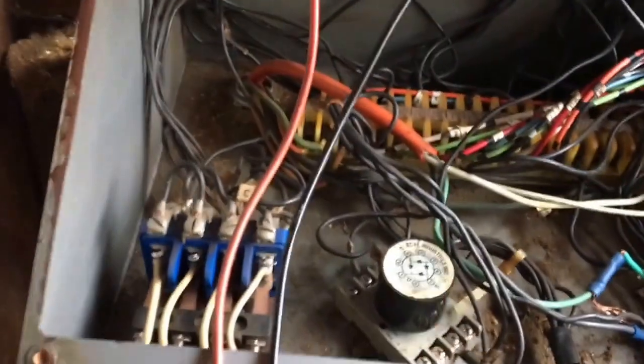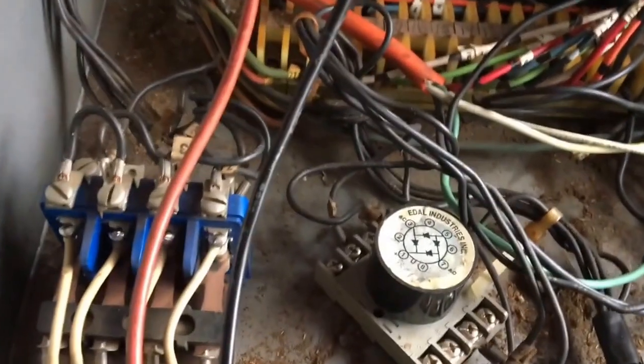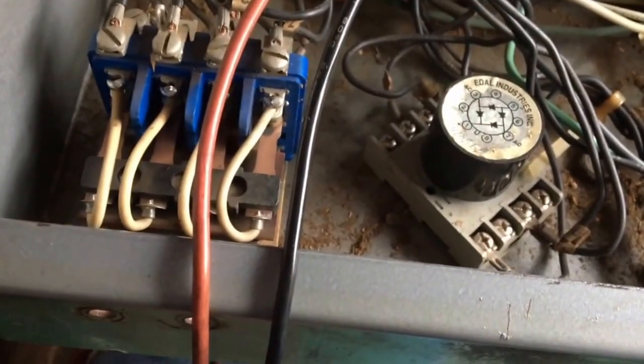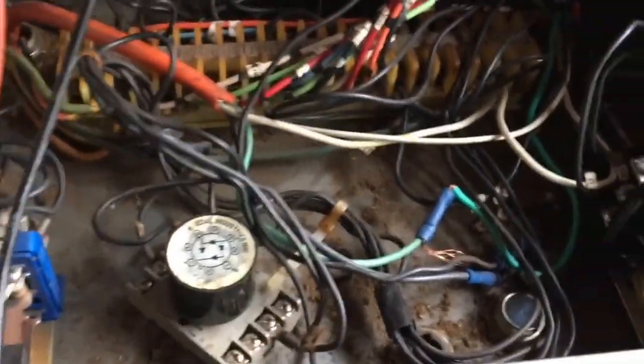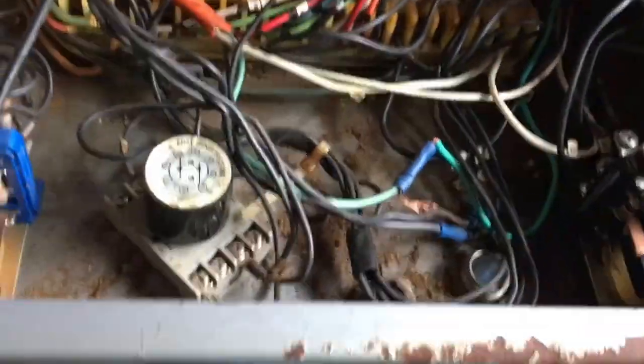It's not complicated. The old guy I bought this mill off of, he said that thing out there is a brain box — said you've got to really be careful of that. And all it is is a little transformer. They are expensive though — I think that little piece is like $90. I blew one one time. If you run too big a fuse in here you can do that, and right now I've got too big a fuse in it. It just needs like a two-amp fuse and I've got probably a 25, so I need to change it.